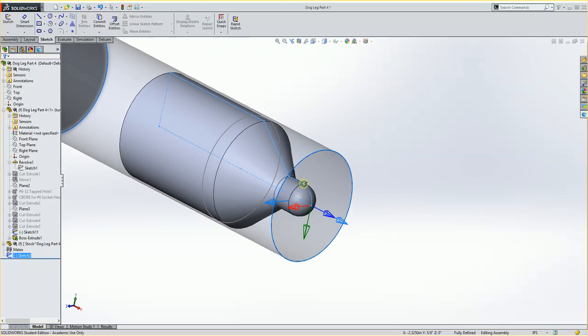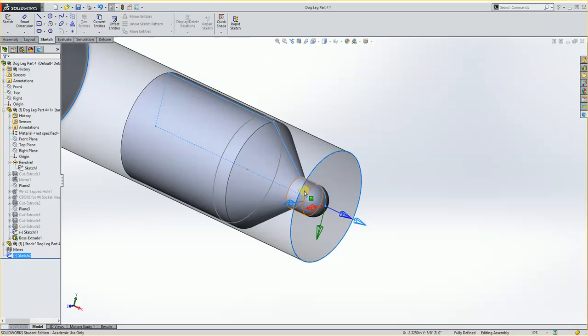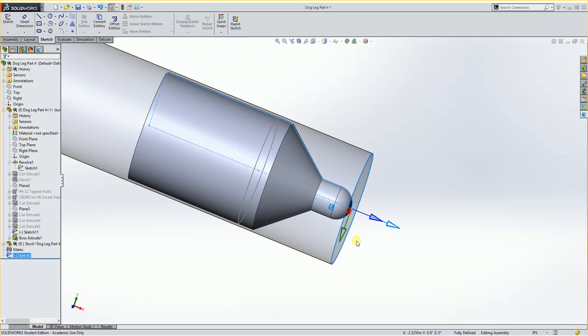Now what we can do is actually put the toolpaths on that we need. We could face the end off, but we really won't need to because we're actually going to be taking this and turning it all the way from the center here. All we're really trying to do here is rough this off, finish it, and then we'll cut it off at the end of the part. The next step, we're going to put it in a 4th axis rotary and do the other machining on it. And then after that, there's even another setup.